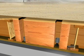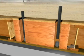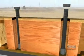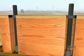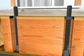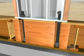Install a coupler nut onto each anchor bolt. Thread the 18-inch threaded rod into each coupler nut. Install the compression nut on each rod flush with the top of the subfloor. Place the wall over the rods and complete the installation similar to the first floor wall. Install the 2 nuts at the bottom and the SDS screws into the top plates.